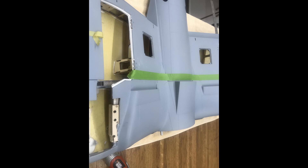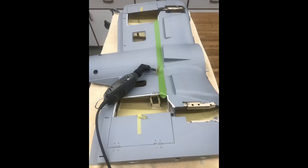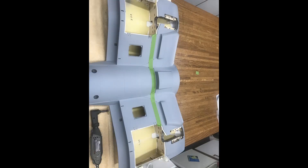Here you can see the three-quarter tape I ran from one side to the other. We're going to be cutting this thing out and that gives us a nice guide to go by. You'll see the Dremel wheel — just a diamond wheel — slide down through there and cut that out in a heartbeat. If you get a little bit too deep, that's all right; it doesn't hurt. Our epoxy is going to make up for everything. Just another view of it. You're going to be surprised when we open this up how easy it's going to be.